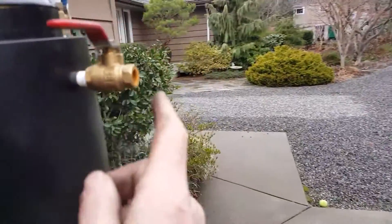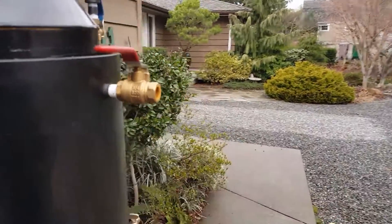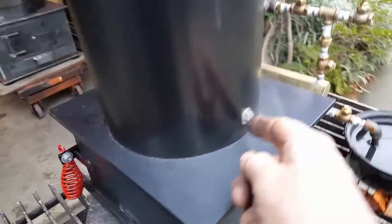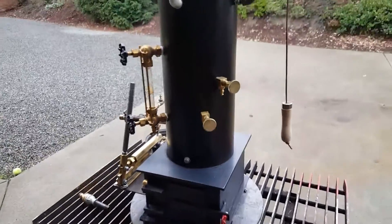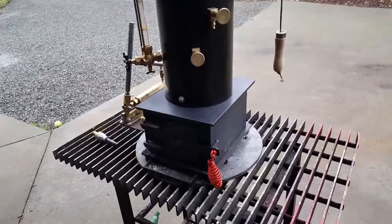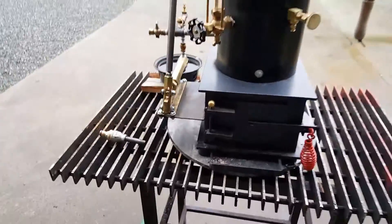Engine out is here — it's a quarter inch. Take your pipe up to that. I've got two bolts, this one and this one here, that removes the boiler from the firebox if you ever want to get in there and work on it. This is a new handle here — it doesn't get hot. Great little boiler.